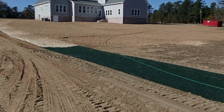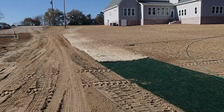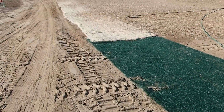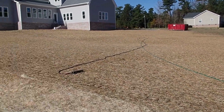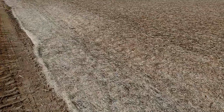So I ended up cutting a swale all the way around the house that was washing real bad, all the runoff coming down here and washing a big ditch out all the way to the pond. So I ran a permanent matting from right here back to the pond. That's where it catches the most amount of water. Regraded the whole backyard, septic field area, got a swale to divert all the water away from the septic field.